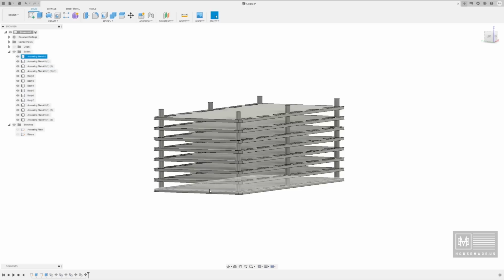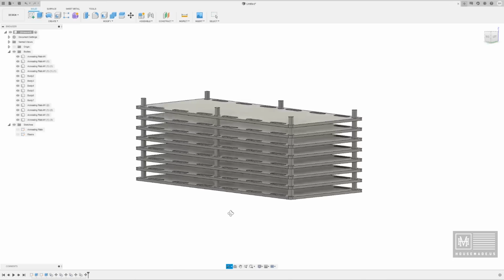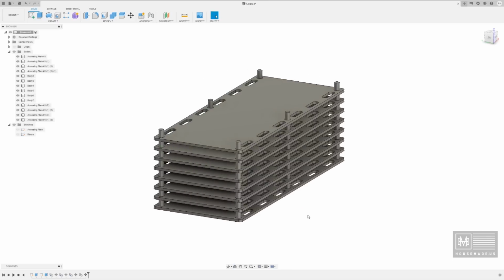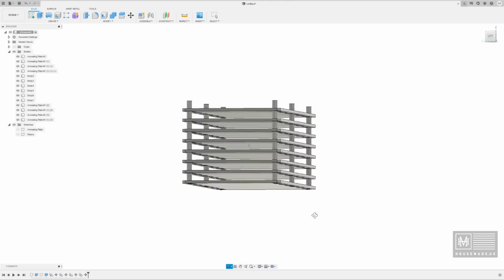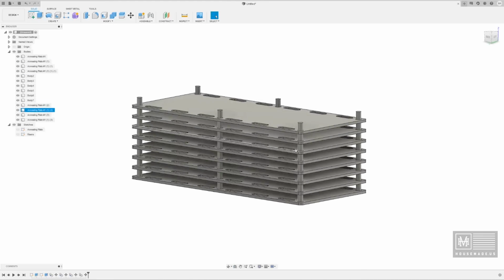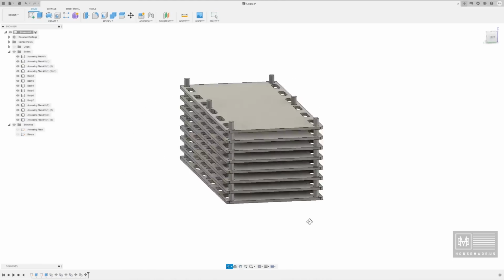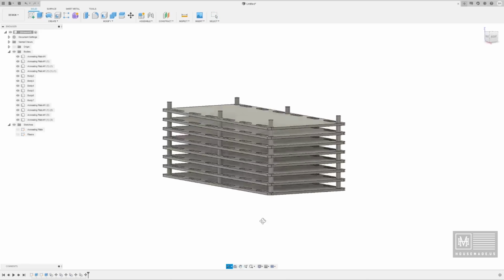And some people may ask me why I need to anneal my steel, because I do stock removal on my blades, and a lot of times the steel comes in already annealed. Well, I cut my blade blanks out on my Crossfire Pro, which is a plasma table, and there's something called the HAZ, the heat affected zone. High carbon steel, once you heat it up and it cools, especially since there's water in the table, can harden. So I need to throw it in my forge after I've cut it out on the table, to allow it to anneal properly, so I can work with it and shape it and not worry about cracking it.